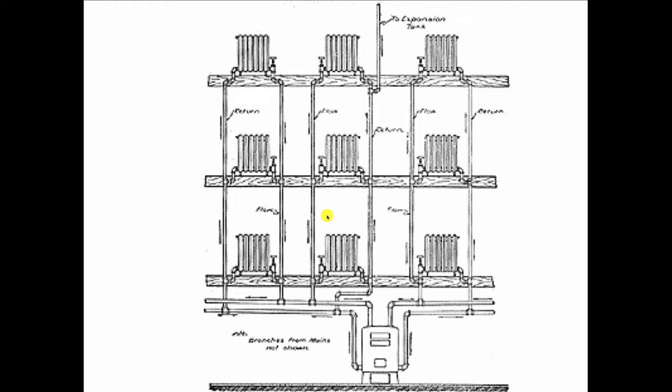And that'll make the radiator hot. And I said, how is that possible? He says, well, again, think like water. You're trying to force your way into this radiator through the valve, but the valve's partly closed or almost fully closed. So you got to fight your way through there.